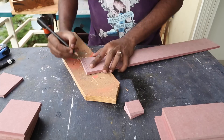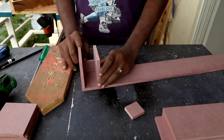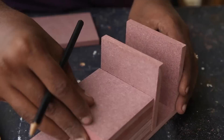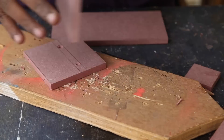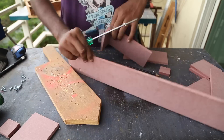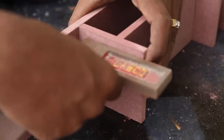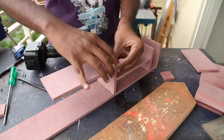Here are the cut pieces. I dry-fit all the pieces together using just screws, pre-drilling to avoid splitting the MDF. The way to put everything together is to start from one end and keep arranging pieces as you go along. I use some spacers while connecting the horizontal boards so they are level on both sides. Sometimes I have to dismantle already-fixed pieces to attach the next one, especially when attaching the horizontal pieces. With that, one side is done — now for the fan housing.